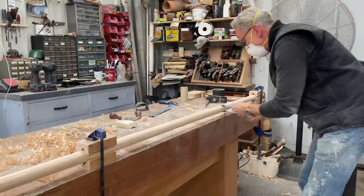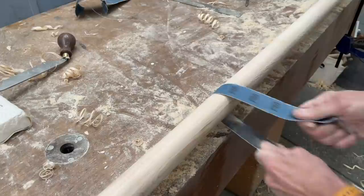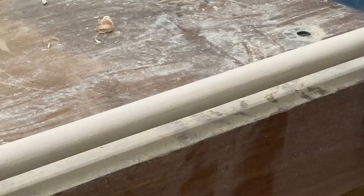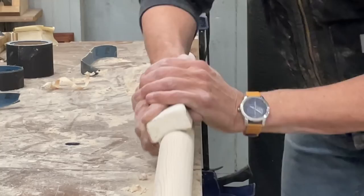I began sanding the spar with some 80-grit sand cloth, doing it cross-grain so that it really rounds it off. I'm aware there's a mechanical way of doing this as illustrated in Greg Russell's book, but I felt that because the spruce is fairly soft and it's a small spar, doing it by hand was a more prudent way. I then sanded with the grain using the concave sanding block I had made. Once I got it all smoothed down with 80, I moved up to 120 and then eventually finished off with 220.